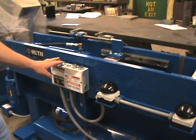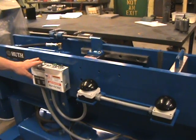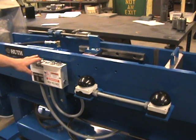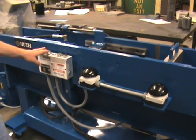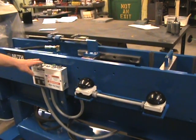These dies are a 1018 material with a case hardening. We also can make the dies out of a tool steel and then put a special process coating on them, which will make them much slicker and harder, and they will last much longer. That is a more expensive process, however.